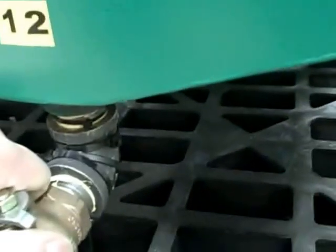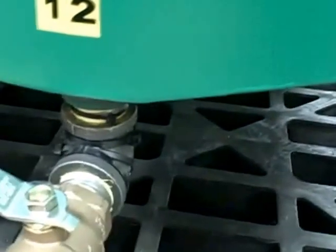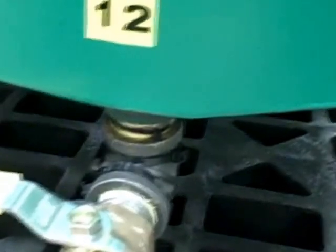I'm going to go ahead and flip the camera around so you can see these other two elements underneath the tank. As we look underneath here, there's one — and back here on the other side is the second one. So these two elements keep the animal fat flowing even though it solidifies at 95 degrees Fahrenheit.